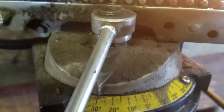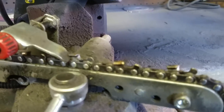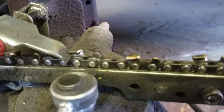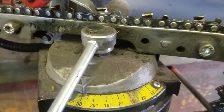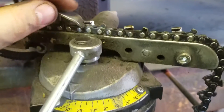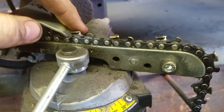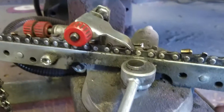Okay, now here's after the second grind. That actually helps quite a bit — you can see how much better those look, more clean. Now I could do another swipe on this, but I'm all about just taking off what I need to make a good cut. And that's a good sharp chain. Whenever you're sharpening these, you're basically sharpening this top edge and then you're sharpening the side. I'm actually pretty happy with that chain.